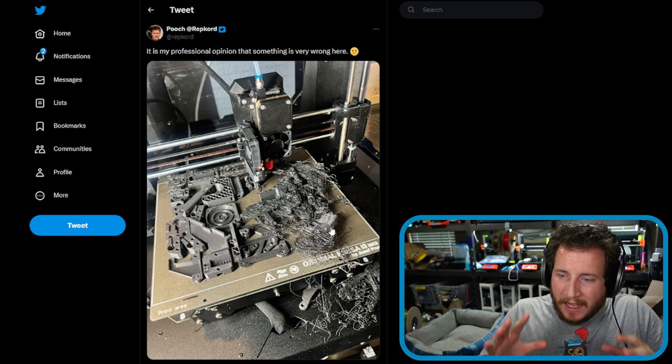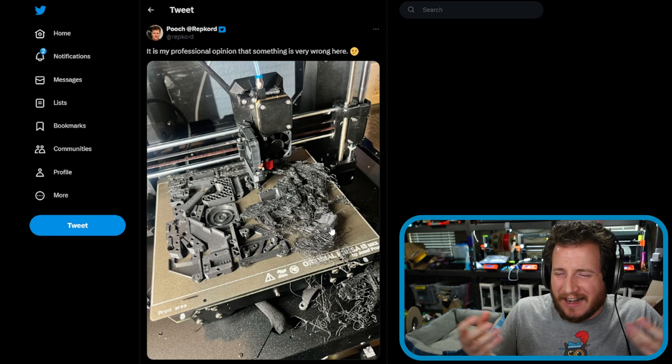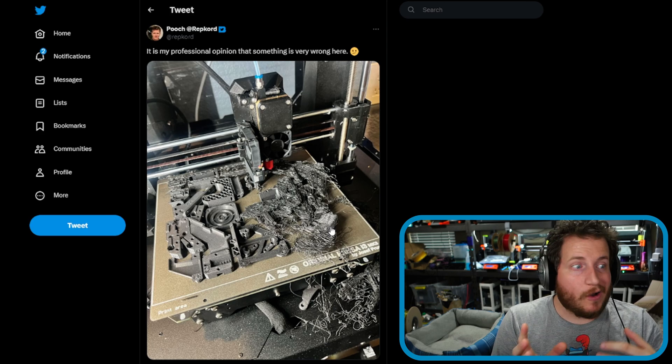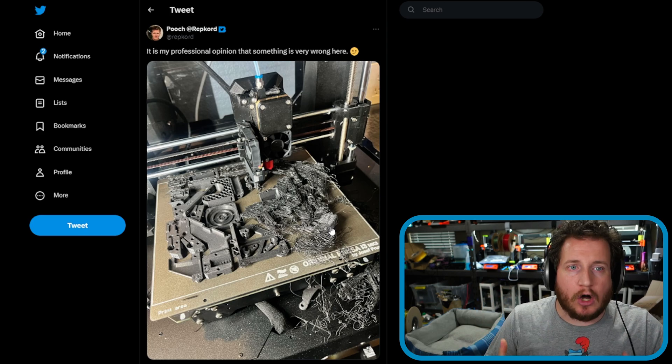Sometimes textured build plates are amazing, other times they're absolutely terrible and I can't get a thing to stick to them. We find that if you are having issues with your textured build plate — be very cautious doing this — you can wipe it with acetone. That will help bring out new bits of PEI; it kind of wears away some of the existing PEI and brings new PEI. For smooth sheets, we tend to say grab a magic eraser or melamine foam. You can buy big bricks of it on Amazon for a couple of bucks — it's awesome stuff. You can basically buff your build plate, and that melamine foam has enough abrasive in it to give more surface area on those plates.